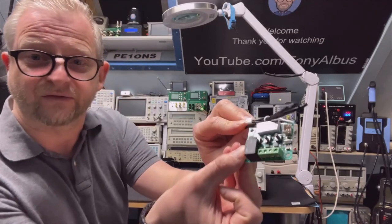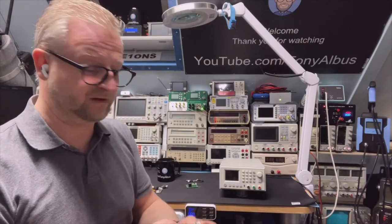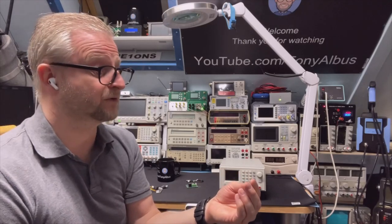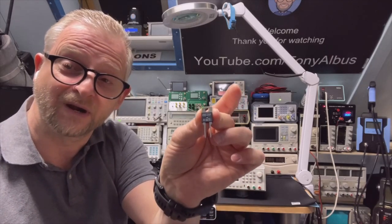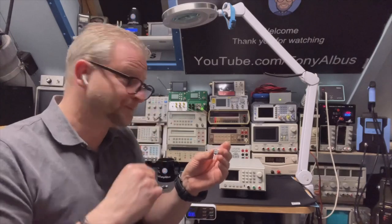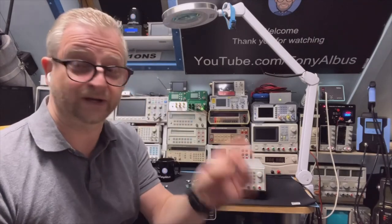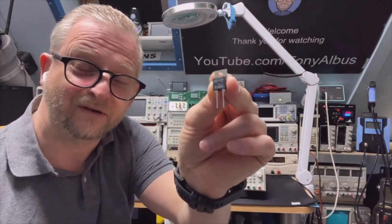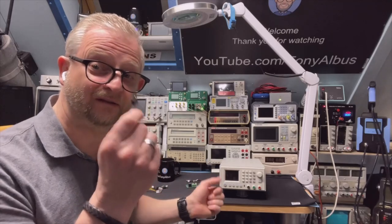It's quite a big piece of electronics just to control a fan, but the casing is big enough so I wouldn't worry about that. There is also an even cheaper solution — I think these are 50 cents. It's a thermic switch and you can buy different temperatures: 40, 50, or 90 degrees. Some are normally open, some are normally closed. If you buy them normally open, at the correct temperature the circuit closes and your fan will run — but again it's on/off.